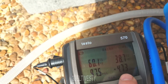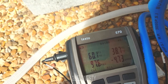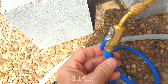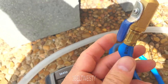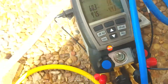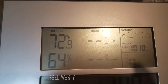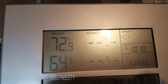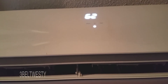This is a pain. The issue with having the gauges running is you get some leakage - I may need to replace the valves. You can zero out the pressure readings but you really need to remove the gauges. I'm about done with this test. These are cheap tubes, the ones I normally use for R-22, and these for R-410 are about brand new but already showing a hernia problem - cheapy set made in China. There's a temperature sensor about 20 feet from the inside unit showing about 73 degrees inside at 64% humidity, and the unit turned on at 62 to try to force super cooling. This unit is really undersized for the room and the whole house - purposely done to just pull humidity out and keep it at bay.